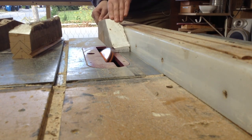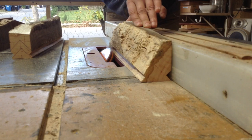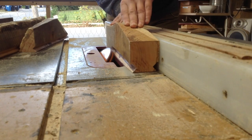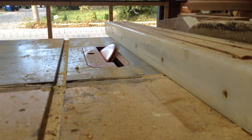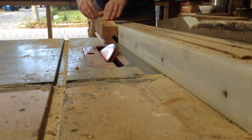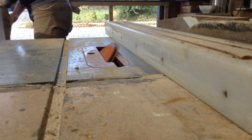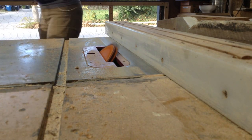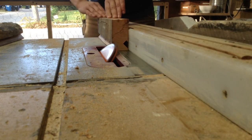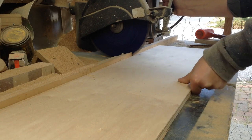This is one of the aspects of the box that's probably a little more in depth — you need a table saw to make these cuts, or you could probably make a jig with a router, but that would be pretty time consuming. You can do this with butt joints, which is just end grain to face grain screwed together. A lot of DIYers have pocket hole screws and you can make a box like this with those if you don't have the capacity to make this sort of joinery.